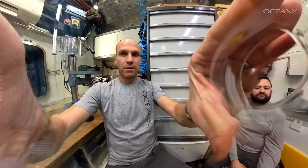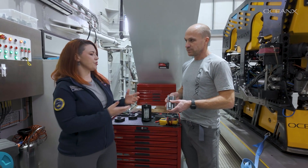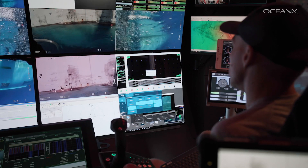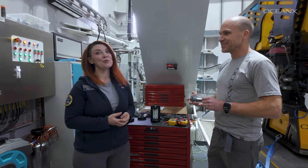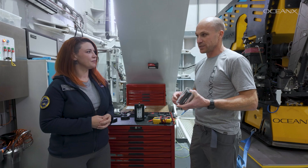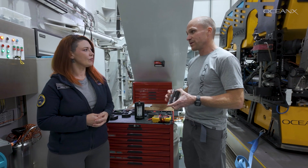What's the biggest challenge specifically with the ROV, since it is one of our deeper diving assets? What's the biggest challenge with pulling things off the shelf and making them ROV ready? Keeping them dry — that's the biggest challenge with our job all around. Keeping them dry and keeping them from crushing. The depth is obviously a big issue, like 600 bar at 6,000 meters. That's basically the main challenge.